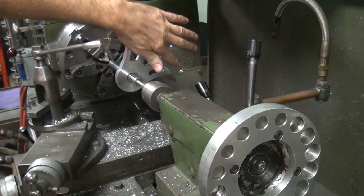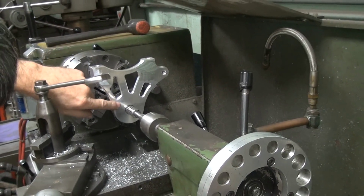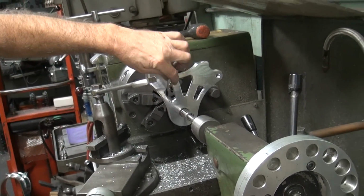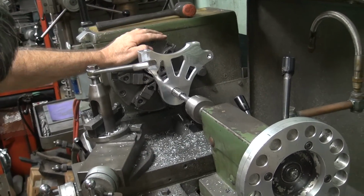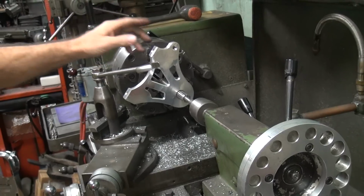So we're cutting here and we're cutting here like we already know. So these are two separate machine marks. This is one cutter, two cutter. Looks like it's one cutter here and one cutter here and one cutter there. Yep. They made three passes with this cutter. They went too deep in the middle. This is all shattered because we're cutting way too fast.